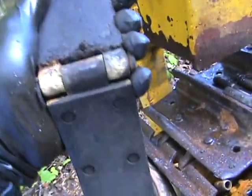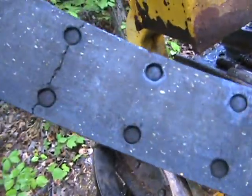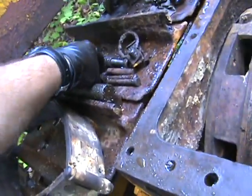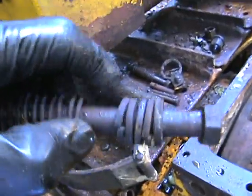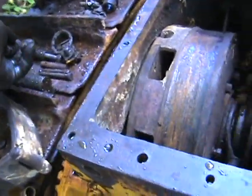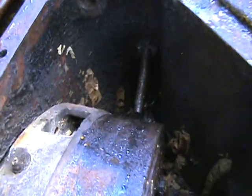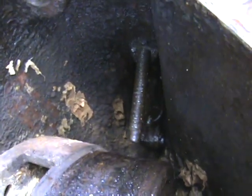This is the right-hand brake band — slightly better, but still in sad shape. The adjusting pin on the bottom to tighten these up had run out of adjustment, so whoever had this last put five washers on there to tighten it even more. There's supposed to be a spring there too — there was no spring.